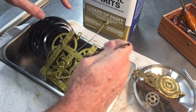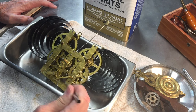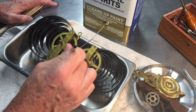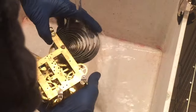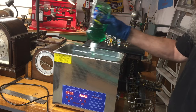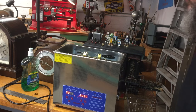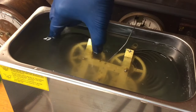I've got just a little bit of mineral spirits here and I'm washing the pivots and getting the dark greasy stuff off. This thing is actually pretty clean — I'm really surprised at how clean it is. It must have been serviced not too long ago. I'm going to go ahead and put this in the parts washer and rinse it off with hot water. I've changed the water out on my parts cleaner and I'm just using some dishwashing liquid in it to cut the grease in the pivots for about 45 minutes or so. This started out as clean water and just after a minute we're already getting real cloudy, so I think this is going to do a nice job of getting all that old oil out of the pivots.